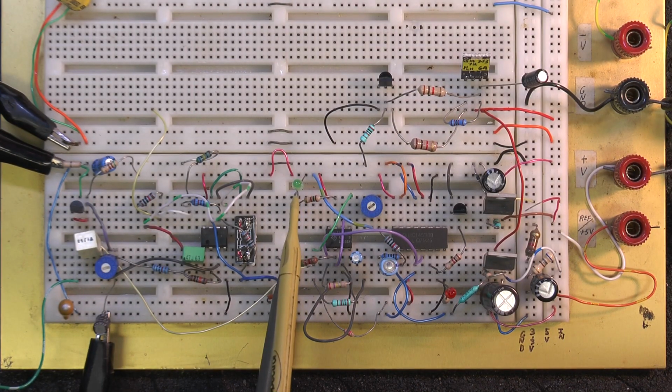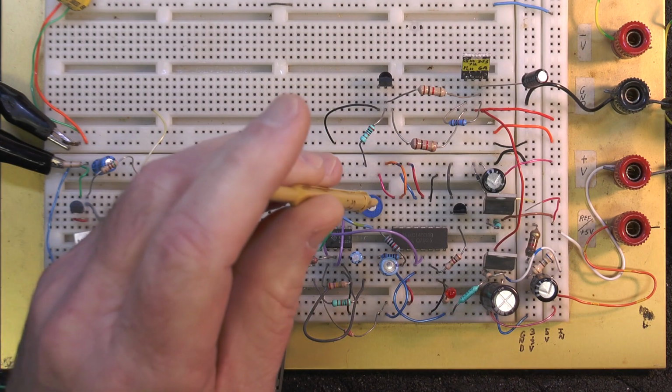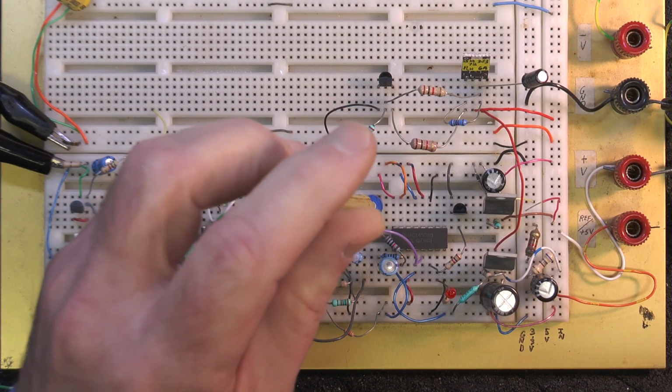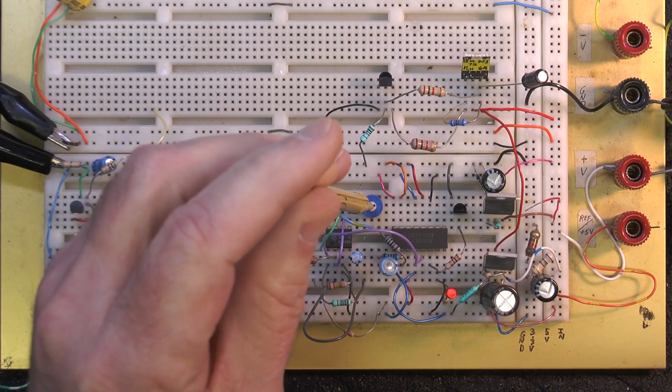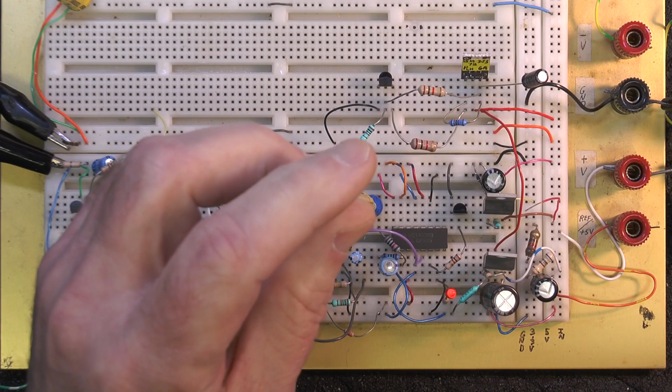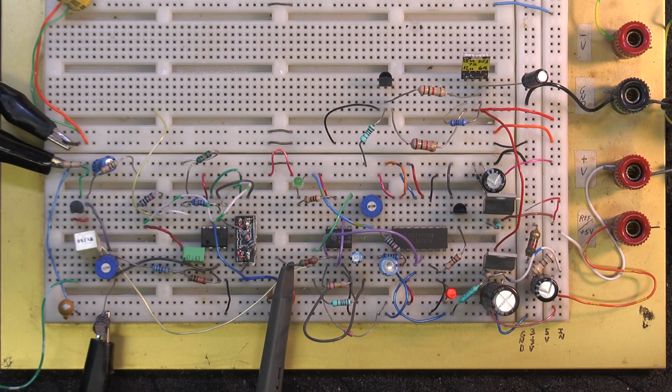Okay, I got some talk radio coming in for testing this thing. The green LED here is the voice modulation, and the red LED is the hold time. This potentiometer will adjust this hold time, because every time this red LED blinks, that would be keying and unkeying the Echolink circuit. So I can increase the timing here. I think I can go up to, if I recall, about 3.5 seconds max. So there I brought it up just a little bit.